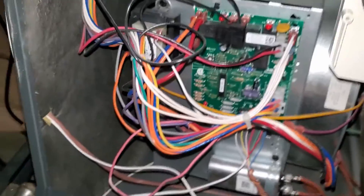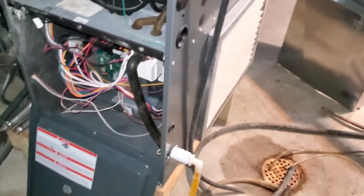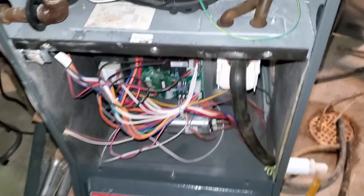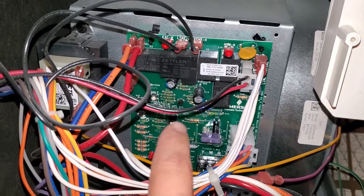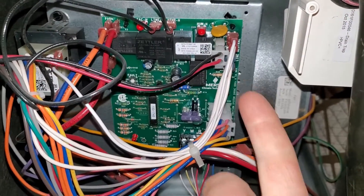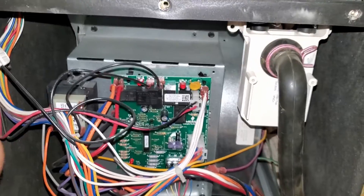So before I take it out of there, I'll show you what it does with the fuse blown. Now, this particular model, it's going to bring the main blower on, and the main blower is just going to run continuous. But in a lot of furnaces, nothing will happen at all. If that fuse is blown, it means absolutely none of these controls down here are going to work, because all the low-voltage controls that come from the thermostat have to come from the power that's going through that fuse. So if the fuse is blown, the heat won't work, the air won't work, the fan won't work. But this one has a safety feature built in, so when we press the switch, it should bring on the main blower and it'll just run it continuously.